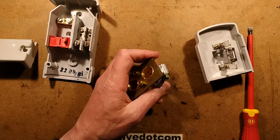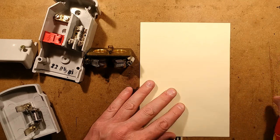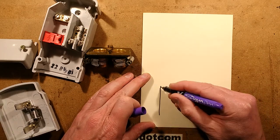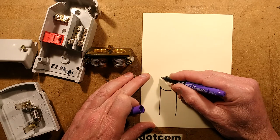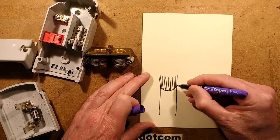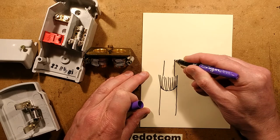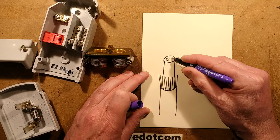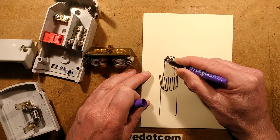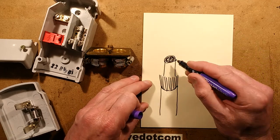These are designed to accommodate what's called a steel wire armour cable. A steel wire armour cable basically has an outer sheath — usually black plastic — then a layer of steel strands in a slight spiral, then another core of black plastic, then the inner cores with their insulation, and then a sort of putty or soft plastic packing — some older ones just had a cord in there to pack out the shape of the cable.